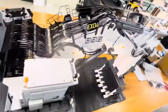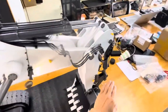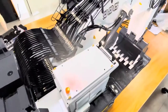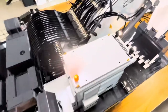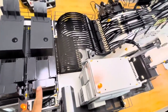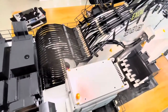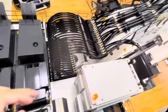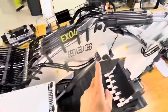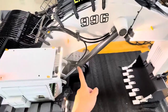For each of these movements of the two cylinders — these two, these two, and these two cylinders — each movement like lifting up or lowering down, we got one set of pressure release valves. For each pair of cylinders, we got two pressure release valves on the distribution valve — one for each inlet side.